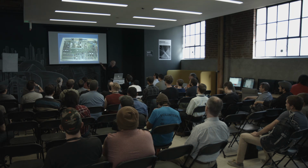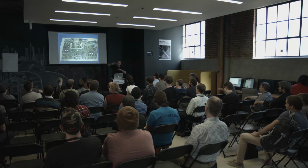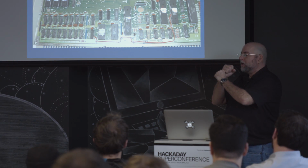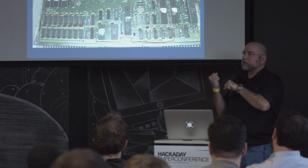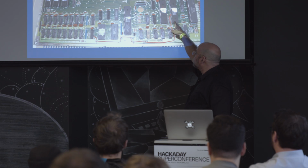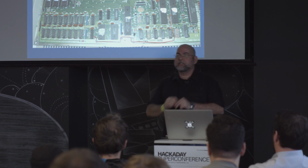I go in here with the scope, and I found it quick. I got lucky. When the Z80's running, there was a ghost on the wire. There was a reflection at just the wrong time. When the 6502 did it, it worked fine. It's like blowing a flute the way you're supposed to. But the Z80 is in a different place on the track, and it's like blowing a flute from the side, and it didn't work. All this wire does is connect the A10 line another way.